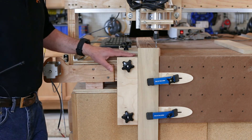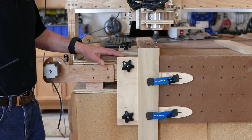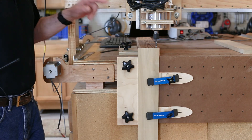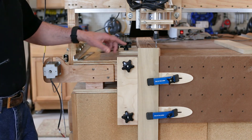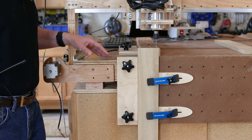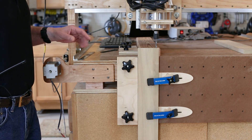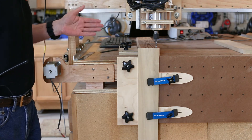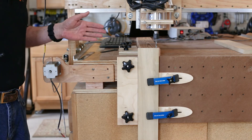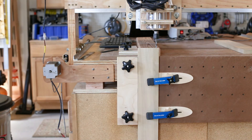This makes the left side of the joints. On the other side of my fixture I would have a mirror setup that makes the right joints, and I can actually set up a left joint and a right joint at the same time — cut the left joint first and have the router go over and cut the right joint. So I can do two joints at a time. But while I'm learning this and getting everything set up, I'm just doing one joint at a time. You can actually double the workload very easily with very little increase in time.